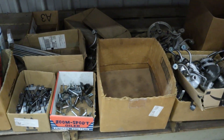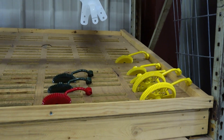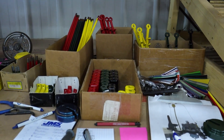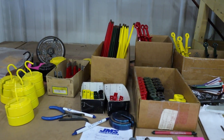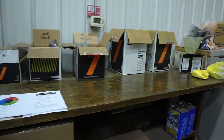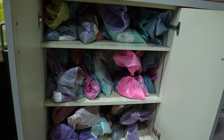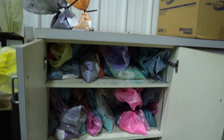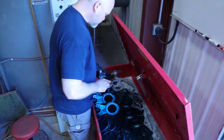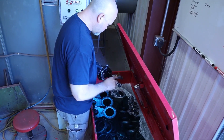After these small parts are built, they come back up here to Rick where they wait to be powder coated. Normally this rack has a lot more parts in it, but we do have a pretty large build this week. You can see a lot of these parts have our standard colors on them and they're actually ready to go right on the machine. We've been doing custom colors now for a few years, and here's a sampling of some of the custom colors we've done in the past. Before we can powder coat, Rick has to make sure each part is washed in a special detergent that removes any excess coolant or any type of oil from the metal that would cause the paint not to stick.